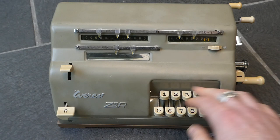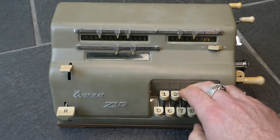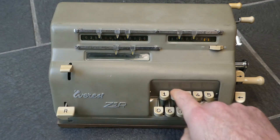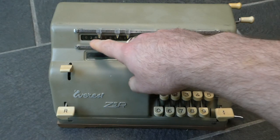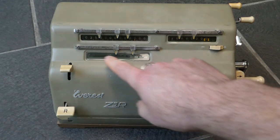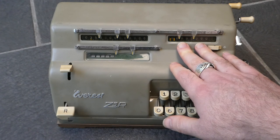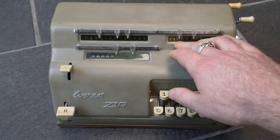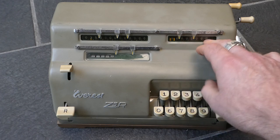You can do division as well. This button here shifts the input all the way to the left so that you can enter a number for division. You'll notice that the counter shows a one in the left-most position — that happened when I entered the first number for the division, the numerator. But when I press this a second time to start the division, this will be cleared. So the counter is all set up for the division. Note it only clears that first digit, not the other digits in the counter, so you do have to be sure it is clear beforehand, unless you specifically want to use those further digits in the calculation.